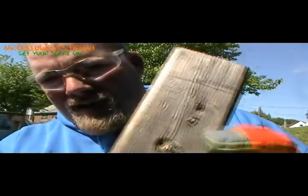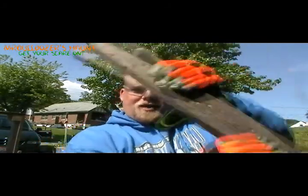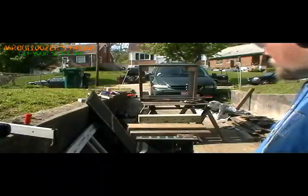What I did was I went around each corner of the box and I marked these off, and I put a number on them. See if you can see that right there. You see that 1? And I wrote a 1 inside the box. So just in case the measurements are off a little bit, I know exactly where this board goes. It goes here, it goes here, it goes here. It saves me a little bit of time. Let's get some cutting going.